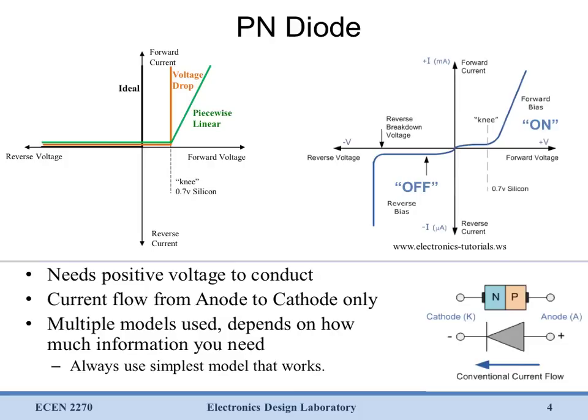To understand how these BJTs work, let's first take a look at a diode. There are a number of different models for diodes. We have the ideal model — just an L-shaped line — which tells you that if you have forward voltage you're going to conduct forward current. We have the constant voltage drop model, shown in orange, which tells us there is some forward voltage we need to overcome in order for the diode to conduct. Sometimes we call this the knee voltage. And then slightly more precise is the piecewise linear model, which gives a slight slope to the current line as we apply more forward voltage, telling us that the more current through the device the more voltage drop we see across it.